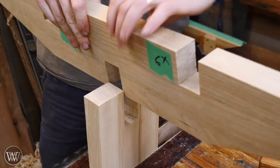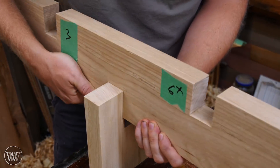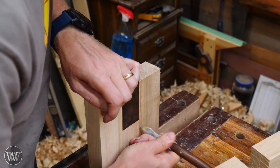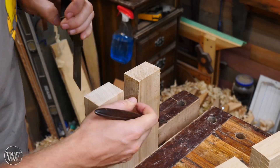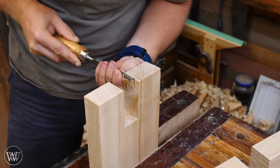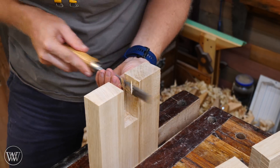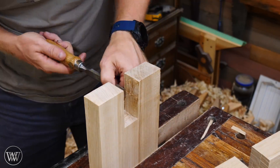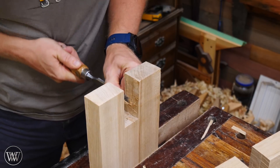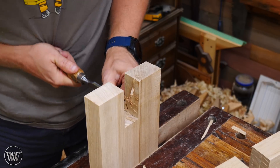We have two joints that should work well together. One of them worked really well — you can test one on the other — but the second half of the joint didn't fit, so it just needs a little more material removed. I'll use a square to mark out precisely how much bigger I need to make the joint. The grain was going the wrong direction, so I couldn't pare down from the end — the grain would make the chisel run away into the block — so I'm just going to stab cut in through the wood, angling it out away so I know I'm not hitting the fibers on the other side. I only need to take off about a thirty-second of an inch to make this thing fit.